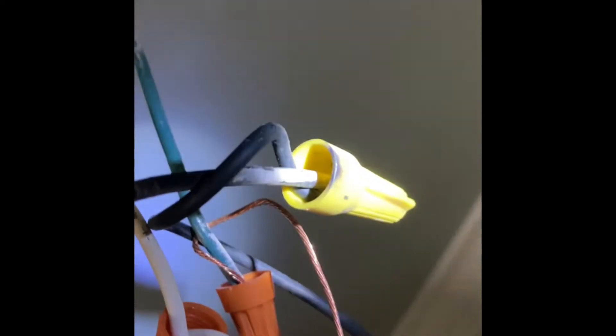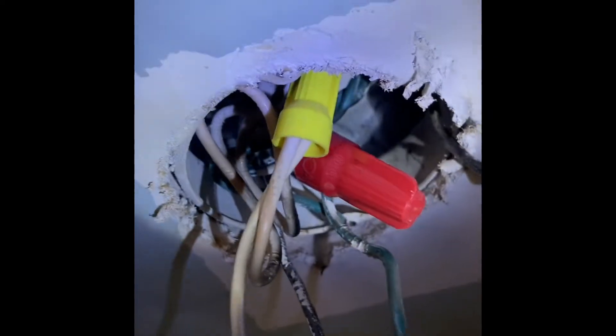What I wanted to show you as I was uncovering this — not only am I finding my electrical problem, but if you see on these ground wires, all that black smut, and right here on this wire nut and this wire, you can see that instead of nice, clean, black insulation, you have smut on the wire nut and on the insulation of this conductor. What that indicates to me is that prior to this issue, there was some arcing or shorting out inside this box — maybe someone driving a screw into the box, or the sheetrock guys with their drill jamming it in and running it around inside the box, which can tear up your wiring.